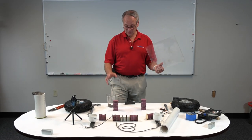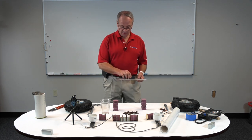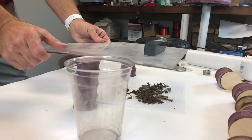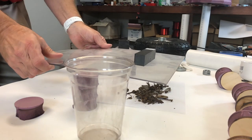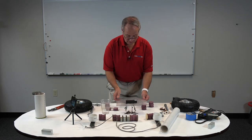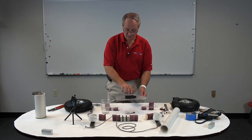To do a little demonstration, we're going to take the debris I have collected, pour it out, and see how well it picks up with the different magnets. We started with a stack of styrofoam getting me four inches above the material. With the four by one by one ceramic at four inches you can see it's picking up nothing. At three inches, nothing. At two inches you can see it picks about half of it up. We would actually have to take it down to one inch to pretty well pick up most of this. As the debris accumulates it increases the distance and weakens the magnetic field for anything else.